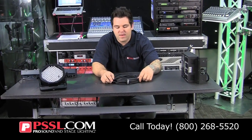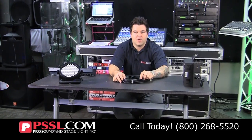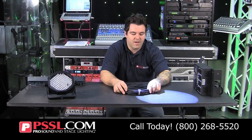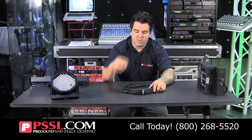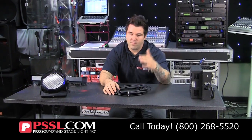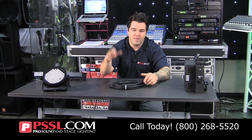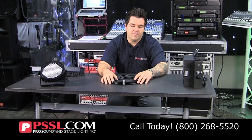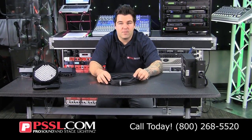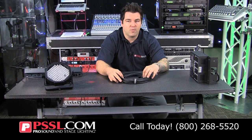Back in the day, back when Jimi Hendrix was performing and you saw all the lights on the stage, there was no DMX back then. It was actually called AMX — it stood for Analog Multiplex. It was a simple two-channel cable that was not very efficient. Essentially, you could control whether the light was on or off, or whether it was dimmed. That was it. If you wanted color changing, you were forced to put a color gel in front of the light. So they found something more advanced: Digital Multiplex, which handles 512 channels of DMX.